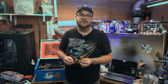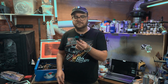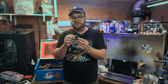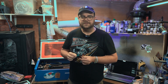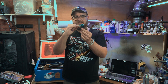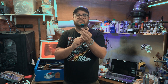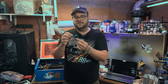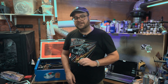It has to be two millimeters because the cutouts are designed to fit a two millimeter piece of plywood. By the way, I'm using a Cloudray laser head — nowadays you can find those blue laser heads online everywhere, they're not very expensive, and they're nice to use because on the side you have this attachment for your air assist. That's where I mounted the entire bracket, so you can easily remove this part, attach the bracket, and hook it on.